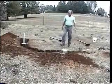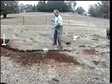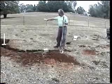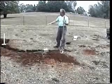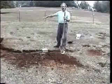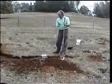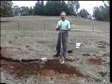The other thing you'll want to do — and I haven't done this yet — is you'll want to dig a little trench in front of this so that you have any water runoff. Once this is all graded and the soil's put back in here, there'll be a little mound where the two inch PVC is, and then you put a little trench in front of this part of the entrance, and the water won't run in there no matter what.